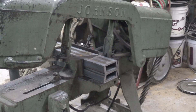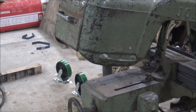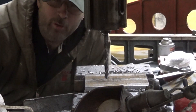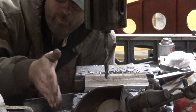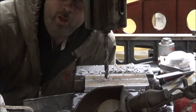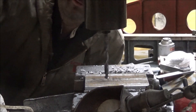I am cutting the caster brackets — these will be what the casters over there on the floor bolt onto. I got green ones for being John Deere and all. So I'm over here at the Carlton and I got two of the feet. I just marked one of them — these are clearance holes for the casters, and the casters are sliding too, so it's not super critical, but I still want to do a nice job. This is an easy way to do it — I can do two at a time. Fire the drill up.